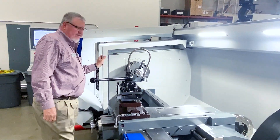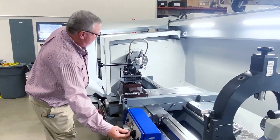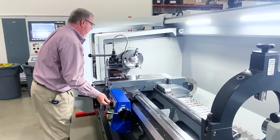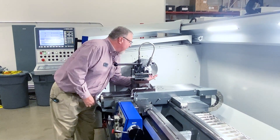I've moved the part, and to prove that we have lost our existing lead, I'm moving my carriage up and I'll put my tool in place to be able to pick up this lead.